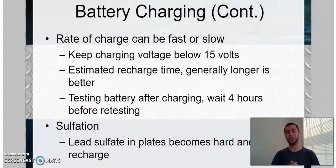Testing after charging: when you're using that machine and it says on some of the newer screens, 'battery voltage too low for testing — charge and retest,' that's what you should do. It is mentioned in the book: test the battery after charging and wait four hours before retesting. Now, if you're a flat rate technician, you don't have four hours unless you have a whole day's work and can keep the vehicle in your bay in the meantime. Try to at least get maybe 30 minutes to an hour, and usually you'll have your answer by then on whether that battery can be brought back to life.